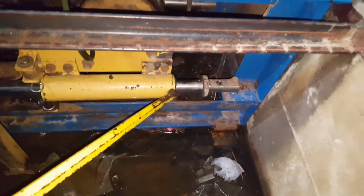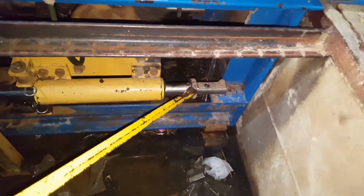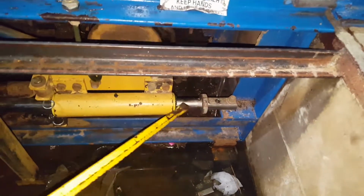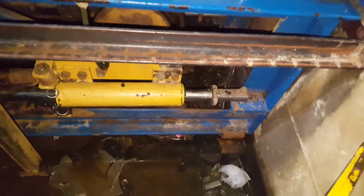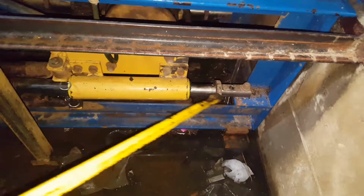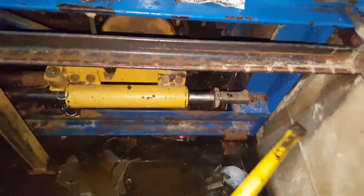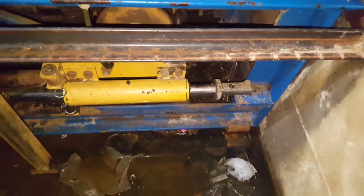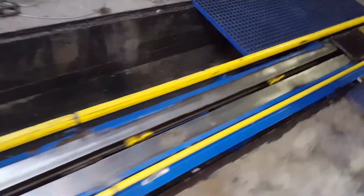So before we took the chain off, this yellow piece was touching this collar, so there was no slack. Now that we took out two links, we got lots of slack, and that'll last us another month or so. Once this thing gets close to here, time to bring the come along. Always take out two links on the log chain. All right, looks good. Here we are running.